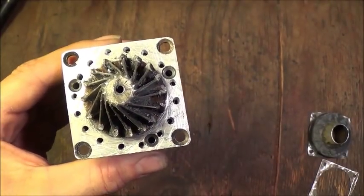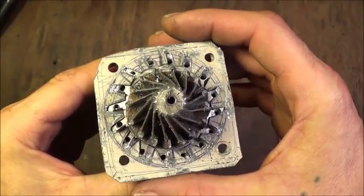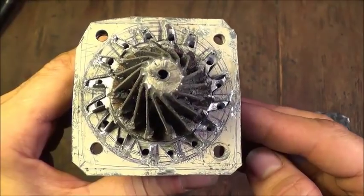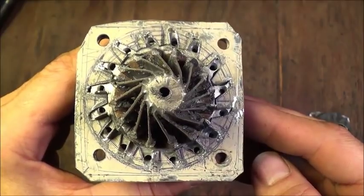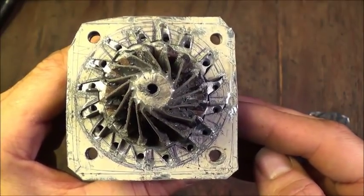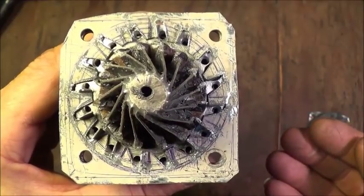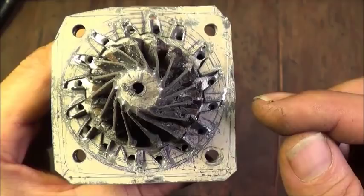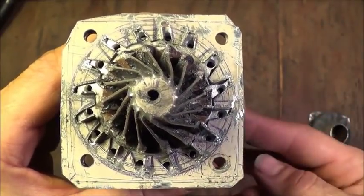One of the things about building a compressor with a diffuser that you're going to want to know is that the angles of the diffuser blades and the angles of the holes underneath it are pretty critical. One of the key parts is redirectionalizing the air coming from your compressor. It does a couple of things: first, it makes shock waves in the air pressure, which helps slow down supersonic velocity air to subsonic velocity. It also creates a pressure trap zone to make sure the pressure inside the engine case can't come back out of those holes up into your compressor.